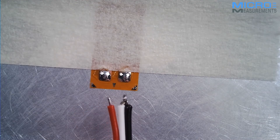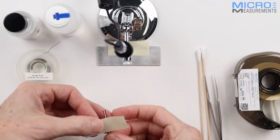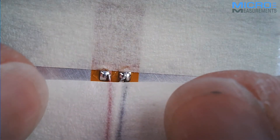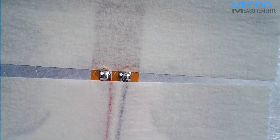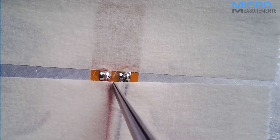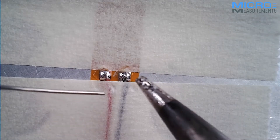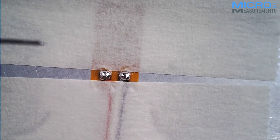Now I've got my pre-prepared lead wire. I'm going to take another piece of drafting tape and use this to hold the wire in place. I'll place the tape over the end of the lead wire and create a little curve to bias it down, then position this so that I can get those wires positioned very precisely. I'll use my tweezers to push the red wire over very slightly to make sure it's in exactly the right position.